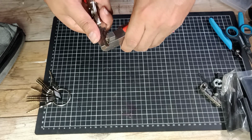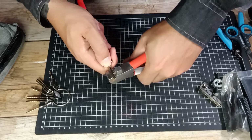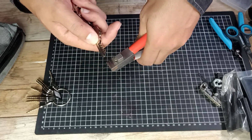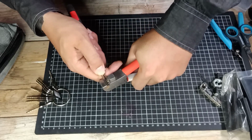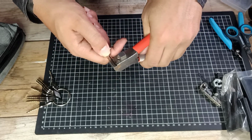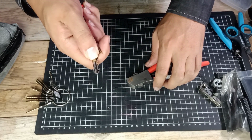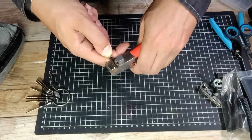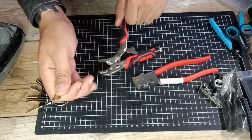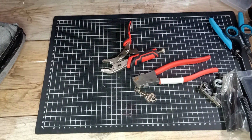So let's go. And again, little cuts. Making sure we hold it as flat and firm as possible. Keep our angles, our ramps, so that our key will actually slide in and out nice and smooth. Really make sure it's pushed in just to get that cut. Like that. And we can unhook that one. That looks alright. I will give it a buff and everything.